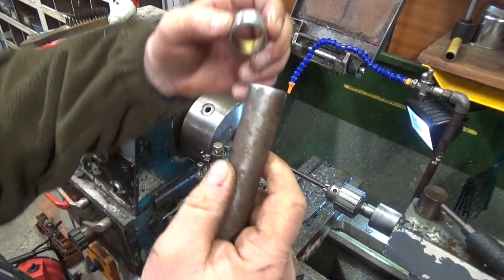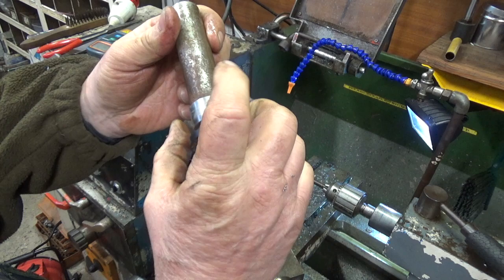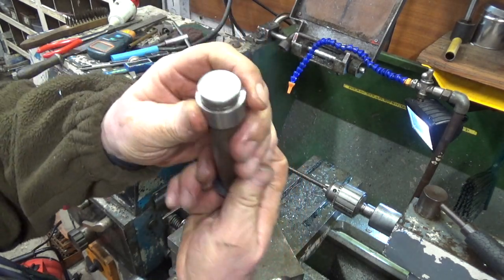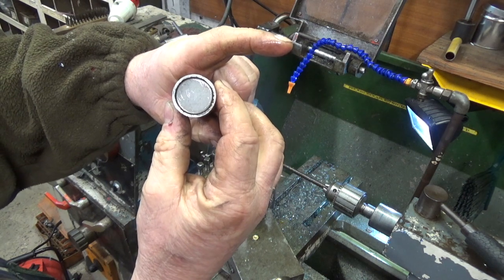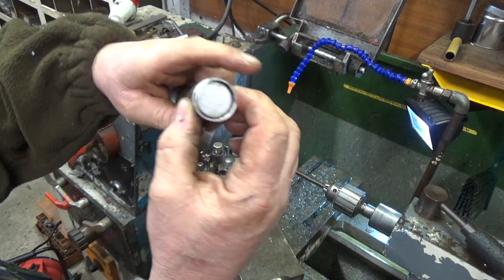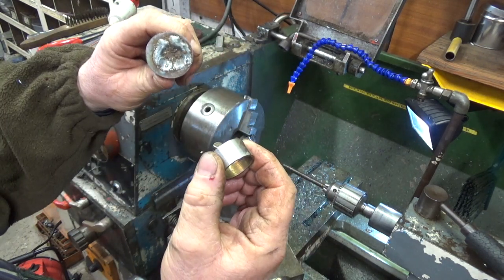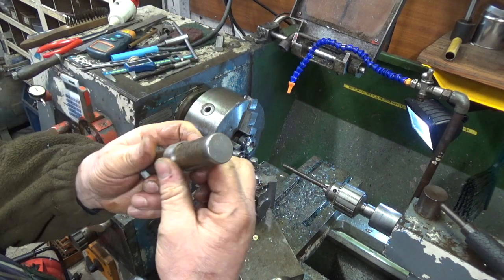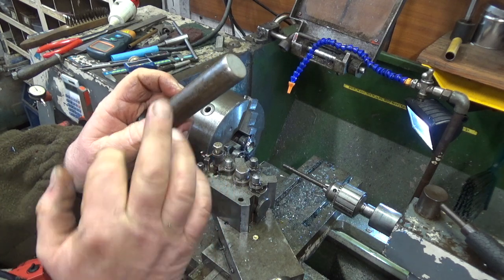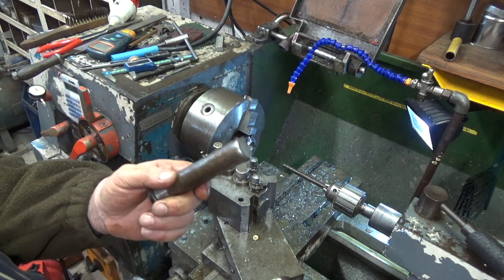Sorry, wobbling around. So that's going to go there. There's a spacer on there, which is a really good fit, I'd say. It doesn't have to be tight, it's only for a front loader bucket. And of course we welded the ends on as well. Right, got a hole to drill in the shafts, in the pins, to stop them coming out, and that's it, back to the mill.